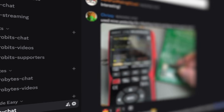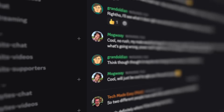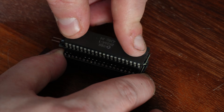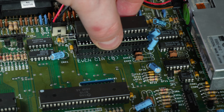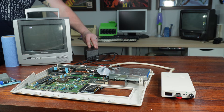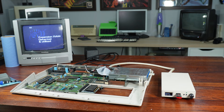If you're into retro technology and the community around it, come join us via the link in the video description. Our original EVEN CIA goes into the socket on top — which is in no way difficult to film — and then we drop the whole thing into the original CIA socket. We connect a toggle switch to the pin headers for an initial test, and the good news is our Amiga still boots. With the switch in its current position, the Amiga boots from the built-in floppy drive as expected — and here we have the loading screen for Lemmings as evidence.